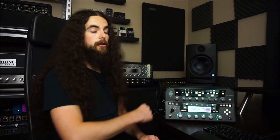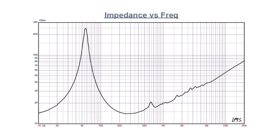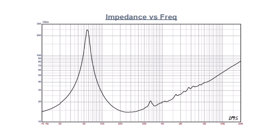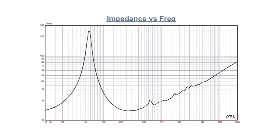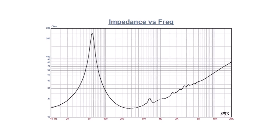Saturated, maybe, but the power amp can really be defined by its output frequency response, which usually looks something like this, because that's what the speaker impedance curve looks like that it's seeing. And specifically with the reactive load I use for all these amps, you can hear the influence of that greenback-looking impedance curve, especially on something with very little negative feedback, like the single rectifier. Obviously, the effect is lessened with more negative feedback in other power amps, but you can still hear the influence.